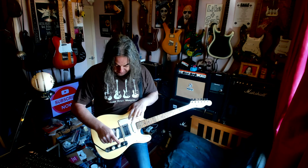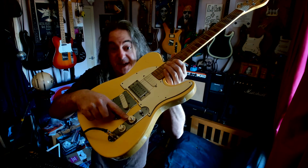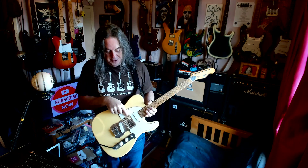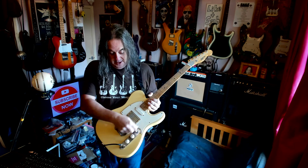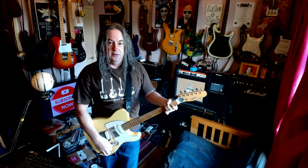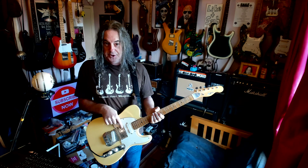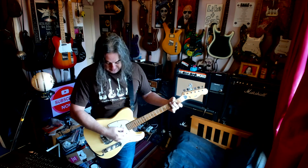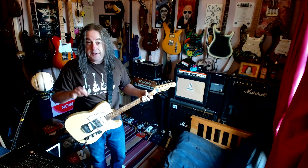So I put this in just to fill the hole - but the wiring actually worked out to be pretty interesting. It's just a normal Telecaster with a three-way toggle, but when you pull up this push-pull pot - I even went to the effort of getting the right knobs, white Jazz Bass knobs were the right choice - it knocks out this coil of this humbucker to make a humbucker out of these two, using half this pickup and this pickup. So you get like a neck pickup and then a neck humbucker. You can't use this pickup on its own; I'm only using half of each pickup.